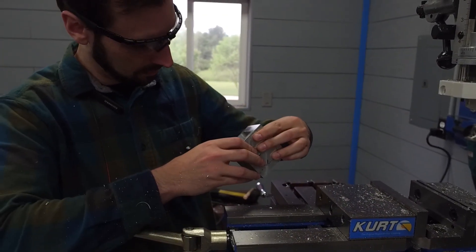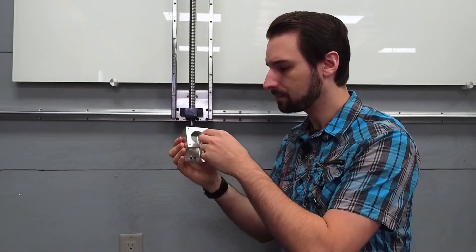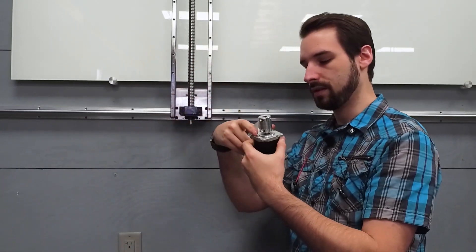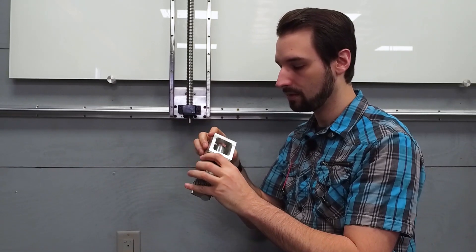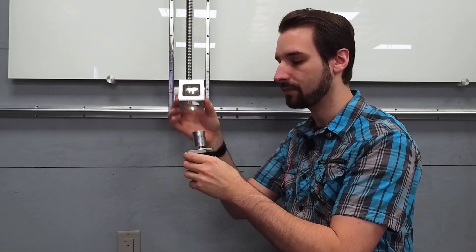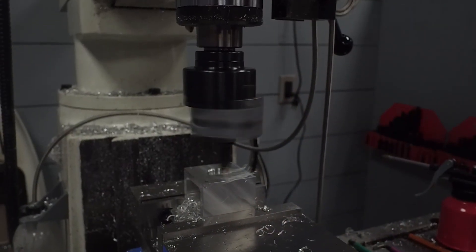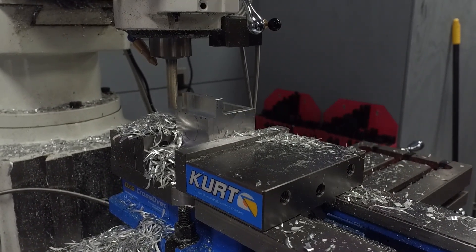In future I'll probably just go ahead and cut it normal. And then I bored out a hole here. There's a little lip — it helps aligning the motor. If you've got that little hole cut nicely so it fits right in there, it helps you center it. So I've got that cut with the boring head, and the rest was just a bunch of work with the end mill trying to cut out all these different features.